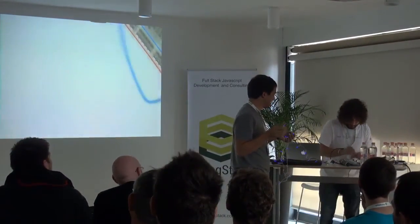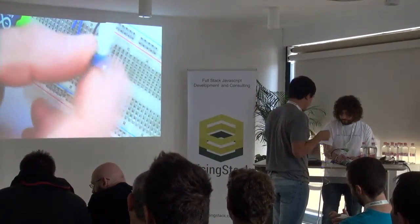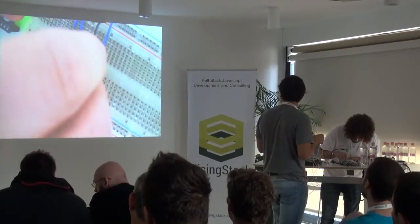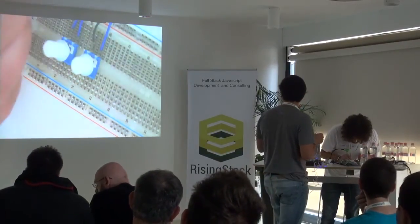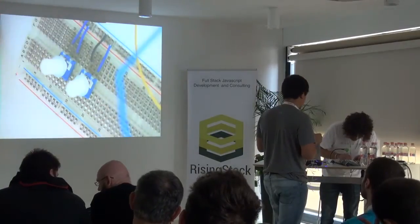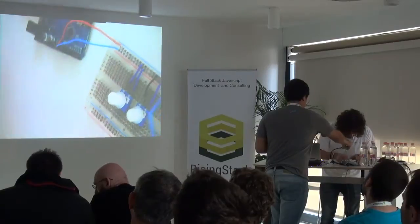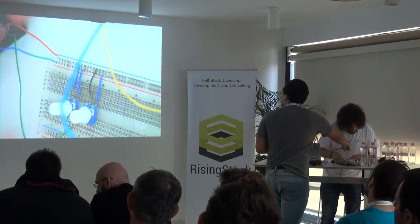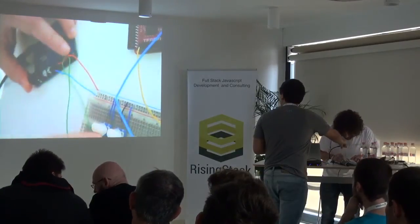One more thing that can work. So I can connect this potentiometer. It's just a thing that I can use to read a voltage. To control a voltage, and you can guess what you are going to do. So I will need some things. I will need to plug this to the ground. Over here, ground, and this other one to 5 volts. And here we go. So we have A2 over here, over here, and A3 over there.